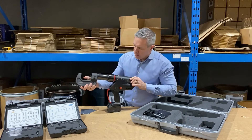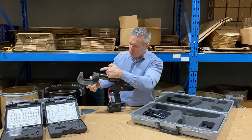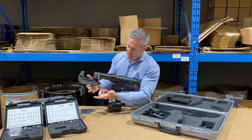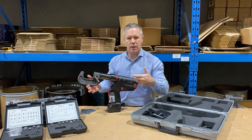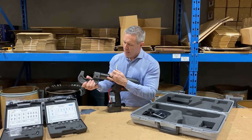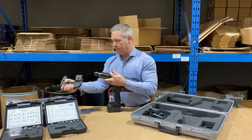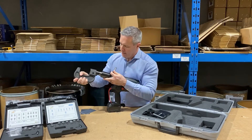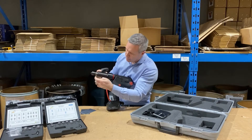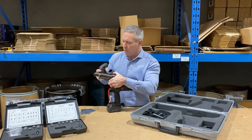On the Riveter, the standard kit comes with the 40mm C-arm. To take the C-arms off, there's a magnetic pin that just comes out — it's actually magnetic so it just sticks here, which helps reduce dropping and losing it. Then you just pull the C-arms off. Before you put it back on, there's a little notch at the bottom, and when it goes through the hole on the C-arm, it fits right into that notch and holds it in place.